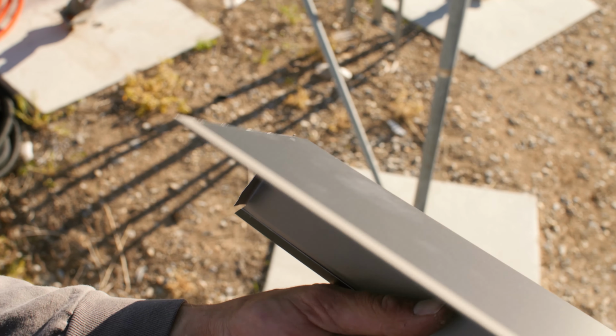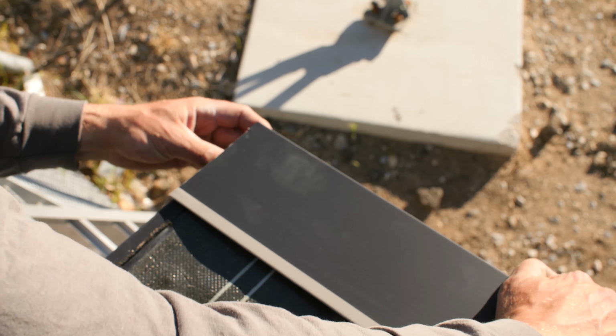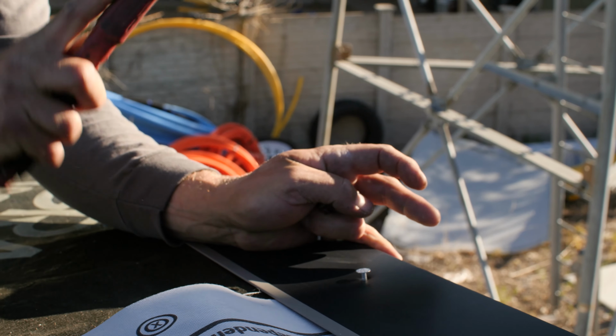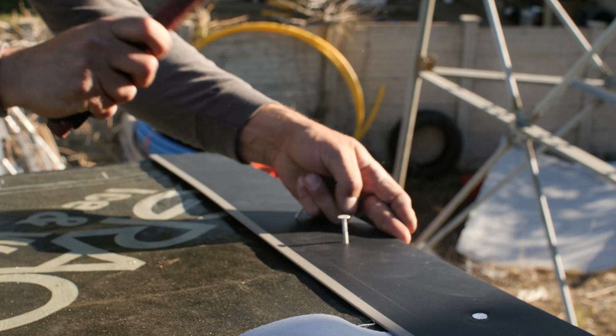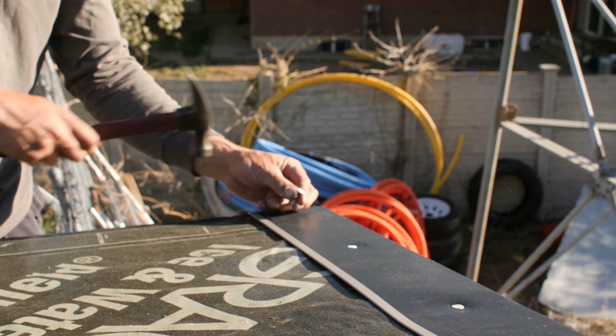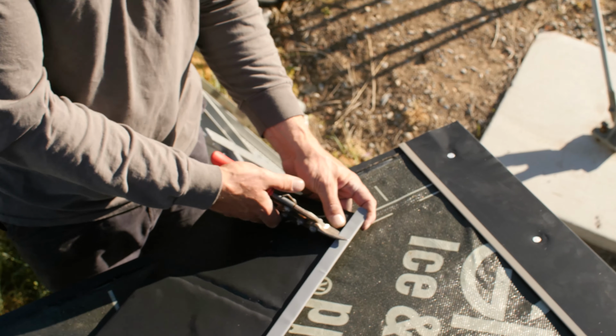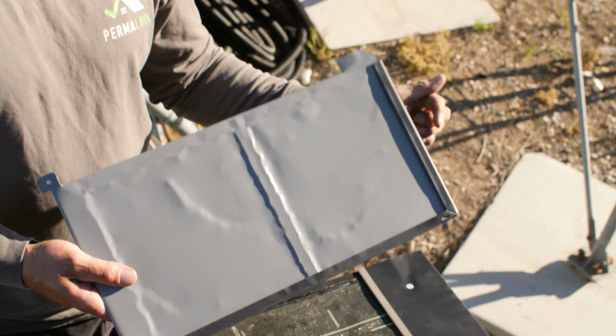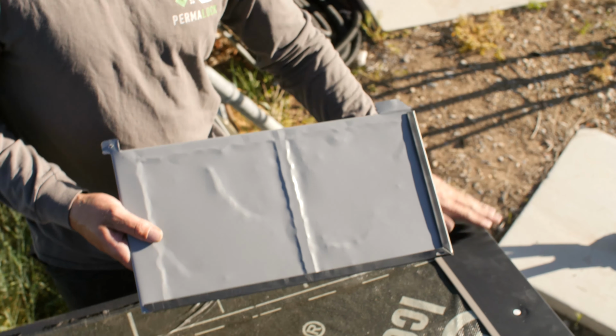Bend around the face of the gable metal to create a tight corner. Place a nail every 6 inches. The first full shingle is ready to install. Cut a nail tab on the left upper lock and slide the shingle into place, locking it over the gable.